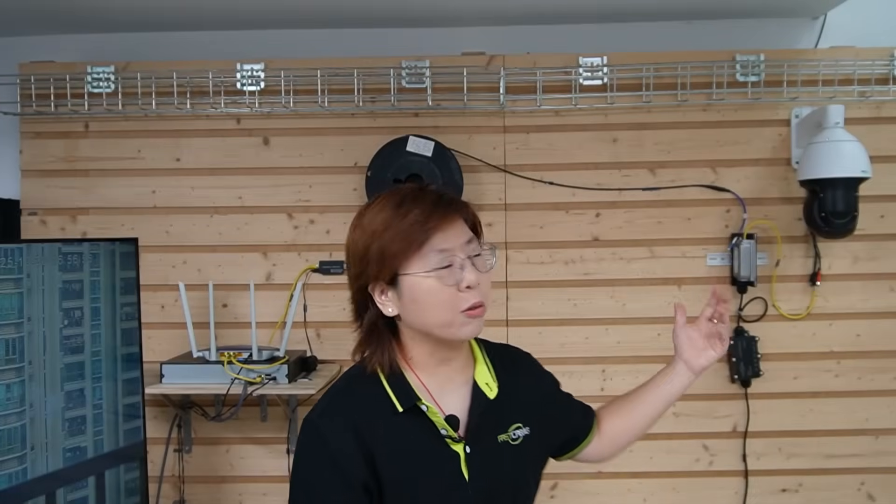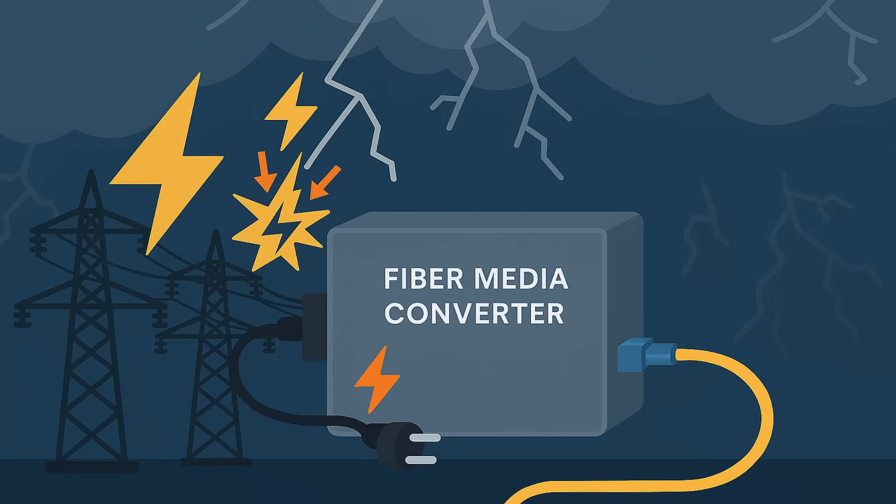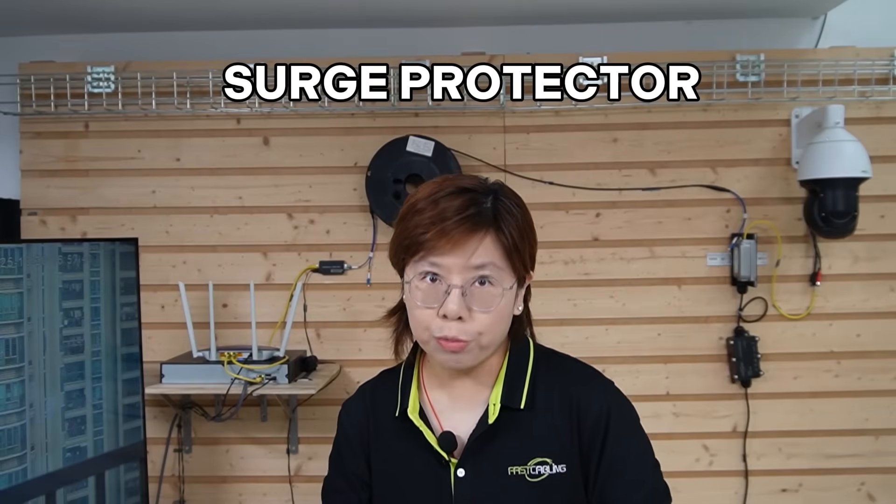We can see all the indicator lights are on, as well as our outdoor PTZ camera. So after using the outdoor media converter, our client fixed the moisture problem. But lightning season brought a new problem: surges. The fiber is glass, so it doesn't carry EMI. But why did the gear still fail? Because the media converter still needs power. Nearby lightning strikes can push voltage spikes through the power grid, and those spikes don't care how perfect your fiber is — they attack through the power side and fry your components. And even though we're using an outdoor media converter, our client is in a lightning-prone area. That's why we recommend adding one more component: a surge protector.